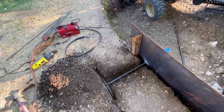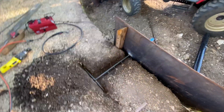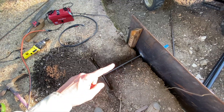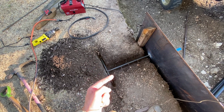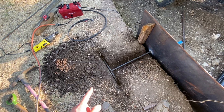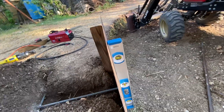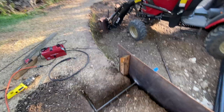This is the technique I'm using for points that are not next to the cement ramp. Obviously on the cement ramp you're able to bolt stuff to the cement, but in these portions I welded a cross member on there. The concept is that if this wants to go out, it's going to have to pull that bar through the soil — and obviously a super long bar coming through earth has no incentive to do that. I'm hoping once I pack this earth in, I'll be able to undo my bracing, and when all is said and done I will still be approximately level.